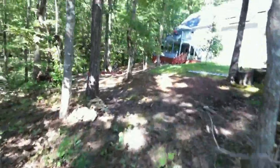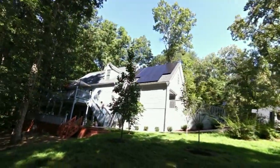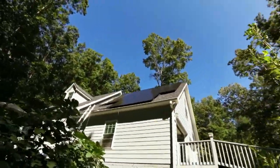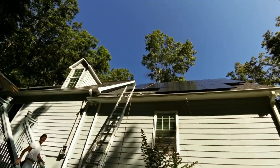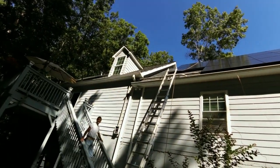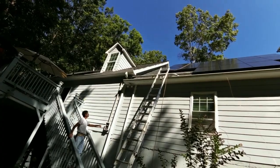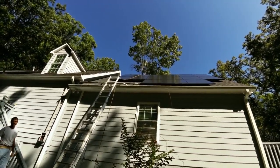Anyway, let me take you inside and show you where I've been working. I have not had an opportunity to shoot a lot of footage of this job yet. I also did not put up the panels — this is a job for another company. There are a lot of companies out of Atlanta that sell battery jobs and hire me to come make sure they don't do it wrong. They actually piped all the home run strings down into this combiner, but it almost meets rapid shutdown because they got a disconnect within 10 feet of the solar array — 10 feet as the crow flies. It's close to rapid shutdown.